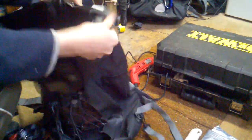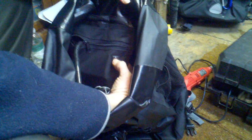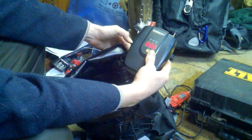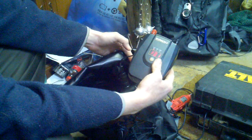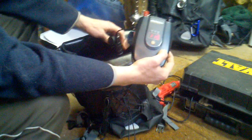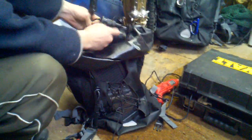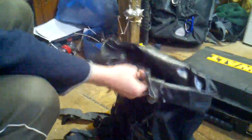The battery is nestled down there in the base. There's a switch built into the fabric. See, the switch is there - turning on the switch now. And I see the inverter here turning on. I'm getting 13.1 volts in, and then it's going out with 115 volts. That solar panel is pretty stalwart - I did a review on it a while back. The maximum output is like 16 volts at as much as 25 watts.